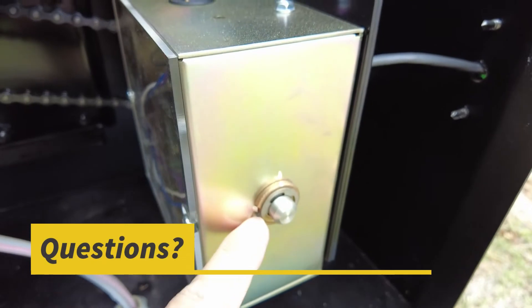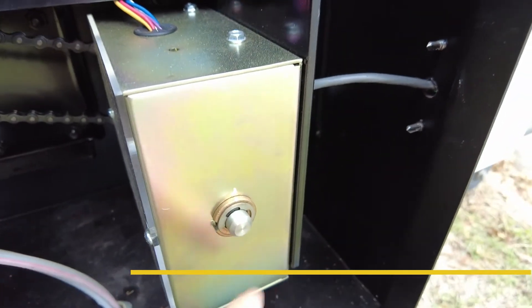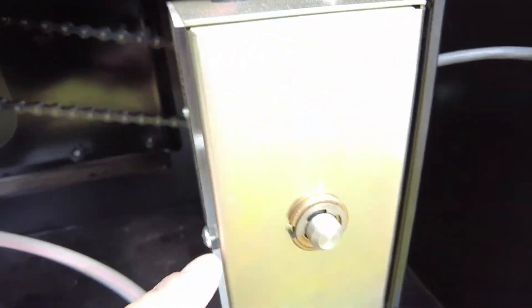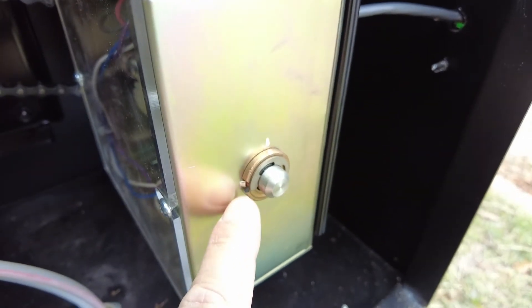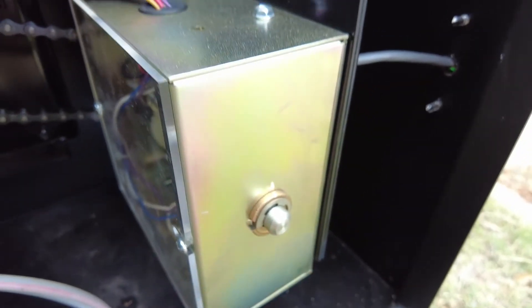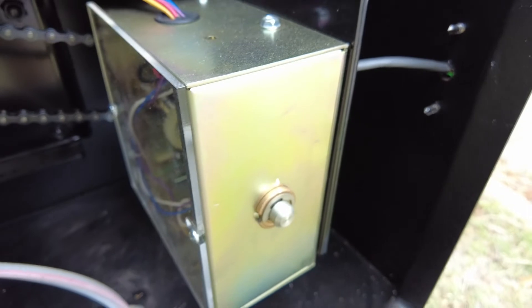On this side you can see basically a duplicate of what's on the back side. The only difference is the axle comes all the way out and has a sprocket for attaching to this limit chain. What happens is this little brass bushing starts slipping — it rides up on this notch and then basically pulls the axle in and out repeatedly. So you never know where the gate is going to stop in the open or closed position.